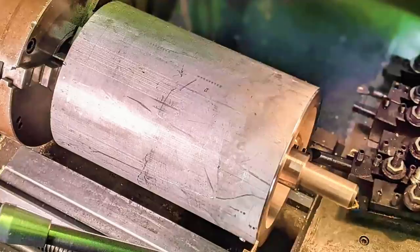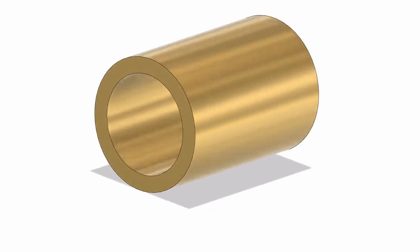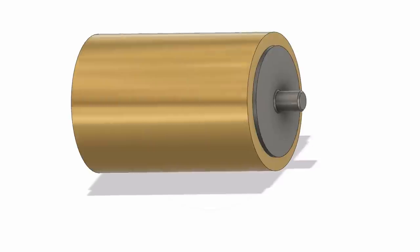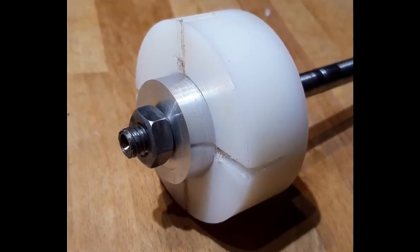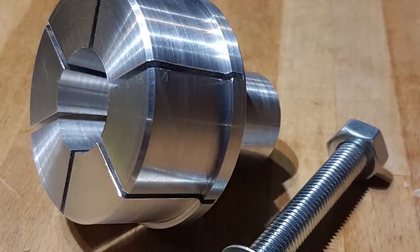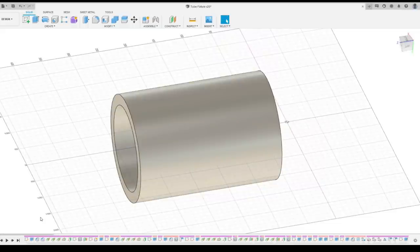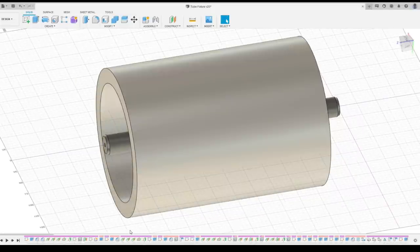I may need to have access to both ends of the tube and maybe some of the interior, so making plug plates with centre drillings for a rotating tailstock centre and something similar at the chuck end, perhaps with a spigot held in a collet or a chuck, isn't really feasible. For smaller tubes, I've made a set of expanding mandrels from acetal, which work really well, but this tube's a bit big and heavy, and I'd have to make a new mandrel for each diameter of tube I use. Perhaps then something adjustable that will grab the tube from the inside and allow it to be held concentric to a shaft and spun at reasonable speed with serious cuts and little risk of death or loss of limbs or digits might be a good move.